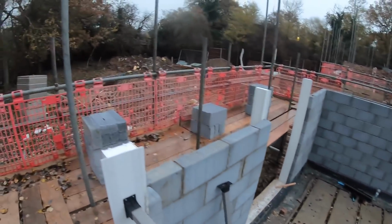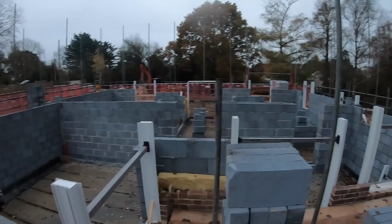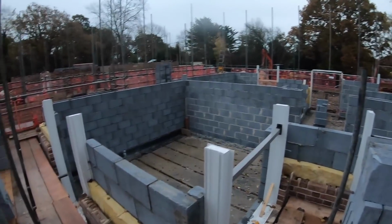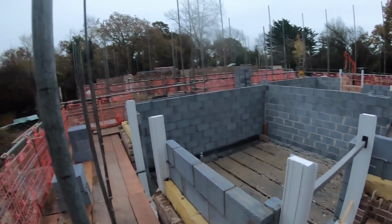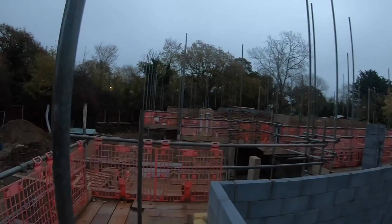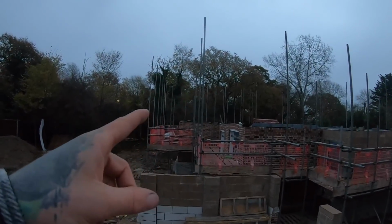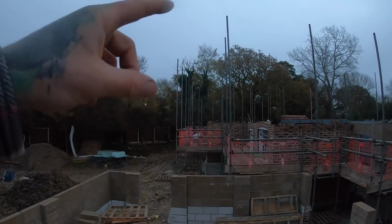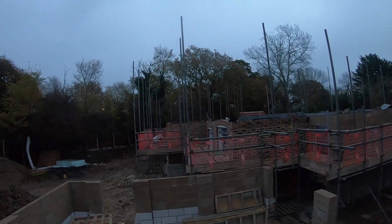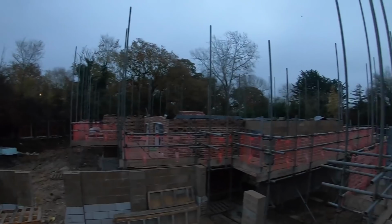and yeah, I'm just going to find out the height quickly to get it up to underside joist. Because we're going to have to come back round again, and probably on that lift over there we're actually going to have to go round again, but we'll probably get like 8 or 9 courses maybe, and then once the floor's on we'll be jumping in and taking the blockwork right up, and the scaffolders will be taking up for the next lift.